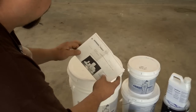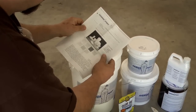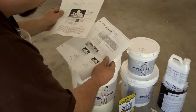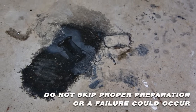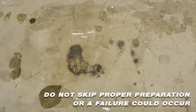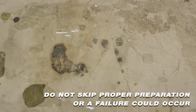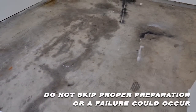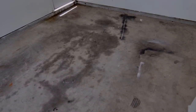Please take a minute to read the instructions for additional information, along with tips to make your new floor turn out perfect. The most critical step in the process is to have a clean, well-prepared surface free of debris, dirt, oil, curing compounds, sealers and loose paint. Even new concrete must be cleaned to remove dirt, dust and salts that form as concrete cures.